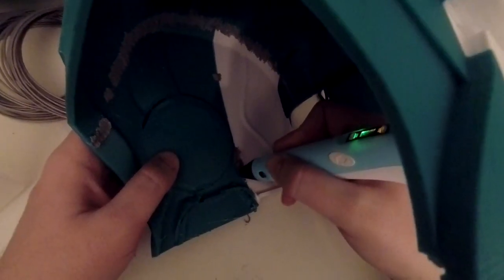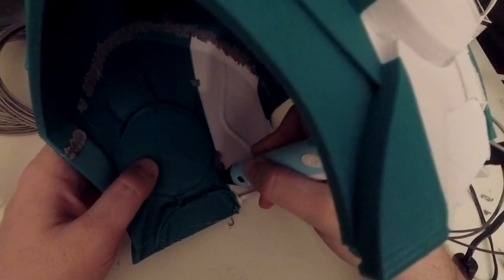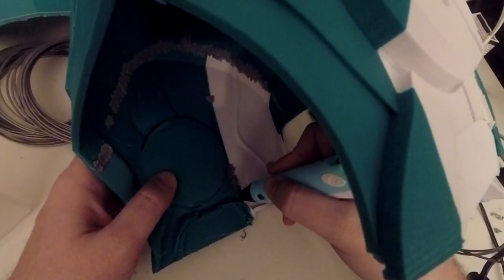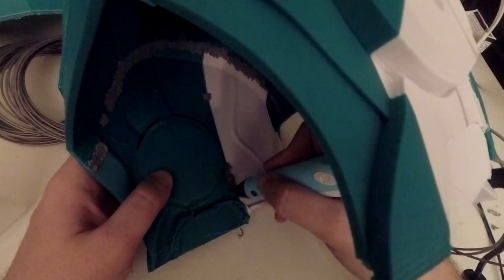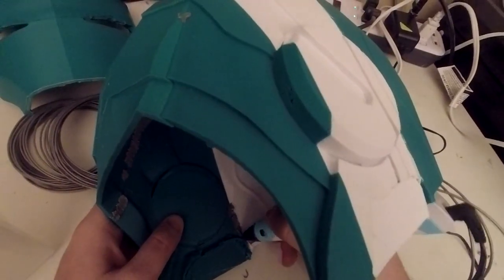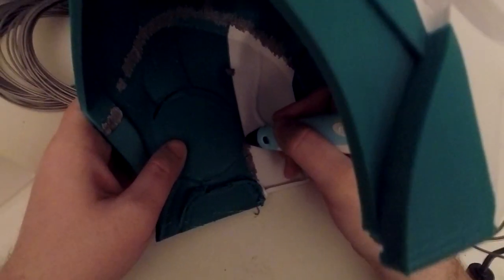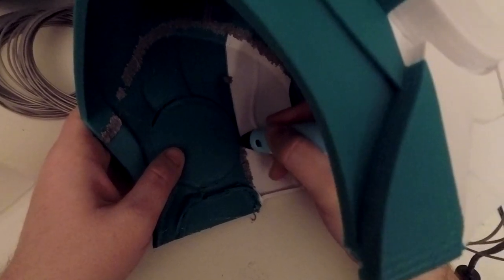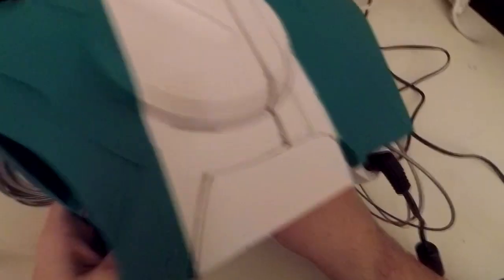It's critical to make sure you're going at the right pace - fast enough that you're getting material out and onto both sides and heating each side, but not so slow that you're melting everything and it's blobbing or seeping down into the seam. Going too slow won't give you a really good or solid weld.